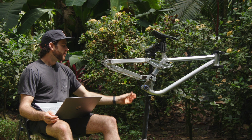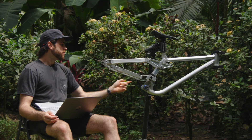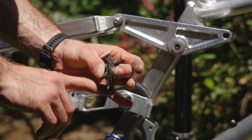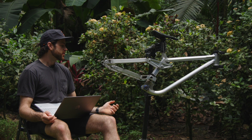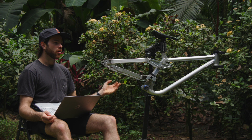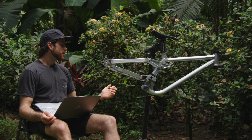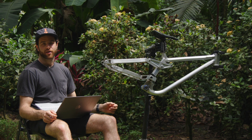I've been really impressed with how this pulley wheel has lasted. The idler pulley is supported from both sides, not just one, so it doesn't wear out the bearing fast. The pulley wheel is 7075, so it's a stronger material — and I wasn't even sure if that would be strong enough. It's been ridden for a while now, it's perfectly straight, not worn out, and barely has the anodizing worn off. It's a 14-tooth idler pulley — as big as I could fit with a 34-tooth chainring. Running an even tooth count of 14, I could use a narrow-wide pulley wheel, which can only help for chain retention.